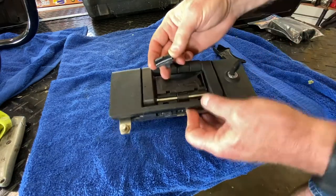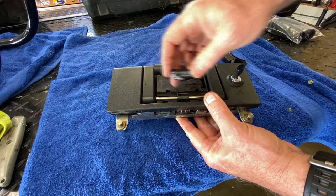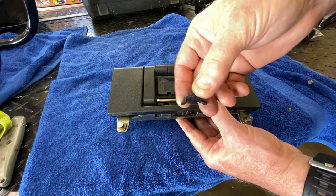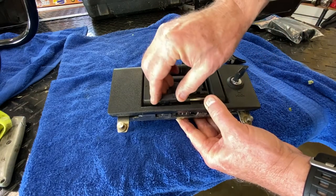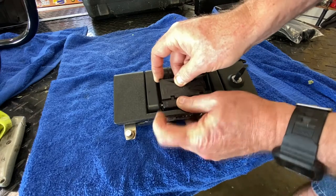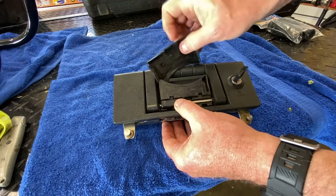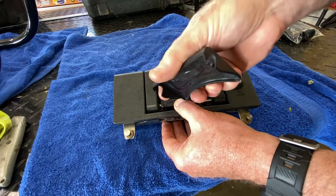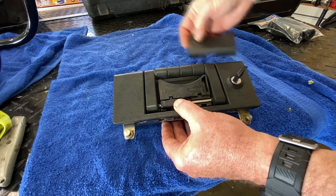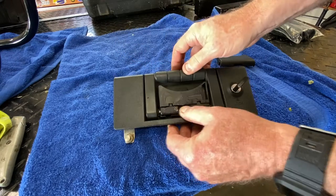It's essentially like a clamshell — almost that other half of the piece that goes around this pivot for the latch assembly. It's kind of clever. You can see it has this feature, which is almost like a T-slot, and that flips around down inside here. You kind of have to lift this up at the same time and it slides in like that. You see how that notch lines up? You do the other one the same way, and then this cover went on. Because of the back side of this being a little curved, it kind of holds these in place. And the bonding between this lid and the latch handle assembly is what holds the thing all together as a unit.